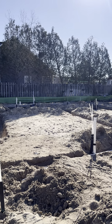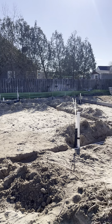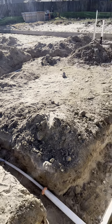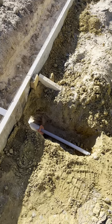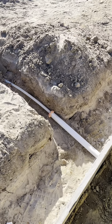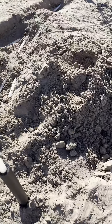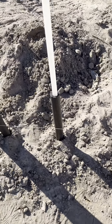Just passed the inspection on this slab where we did PVC and Uponor for the piping under the slab. I'm going to walk you through the whole thing. Here is the one-inch Uponor coming into the house, going through a sleeve, protected from the footing, comes over and turns right up here, then 90s up.